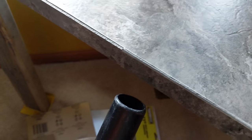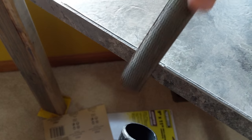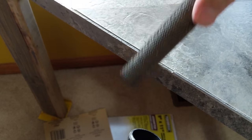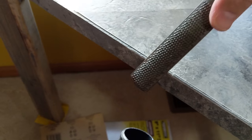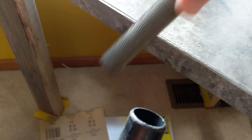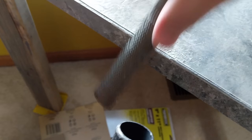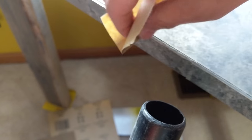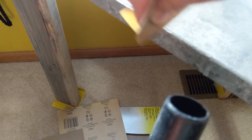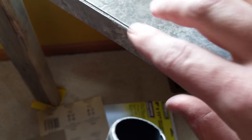And so then what I do is I bring a vacuum in, collect the dust, and just start sanding away at it here. It's easier to do with two hands, but one's holding a camera. But kind of curl it around like that. Vacuum the dust up, and then I do it longer than this, but just to give you an idea, then you come here and sand it with the 120 grit, and that makes a pretty smooth surface.